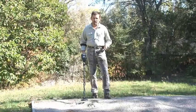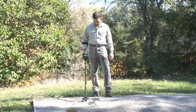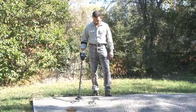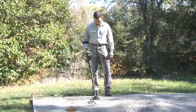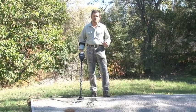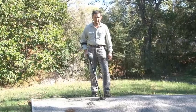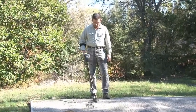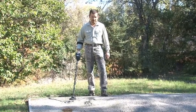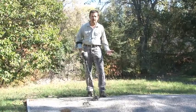To overcome divots and humps in hot mineralized ground, let's increase the ground balance window. Starting by going up to one — we've got a strong response going in. At one, you can hear there's a little bit of response still, but it's already starting to flatten out and calm down. Going up to two — it's much improved, although I'm still hearing just a few tails of response. So in this case, I'll go ahead and run it up to three on my ground balance window. Now I've got really stable operation, even in this hot mineralized ground.